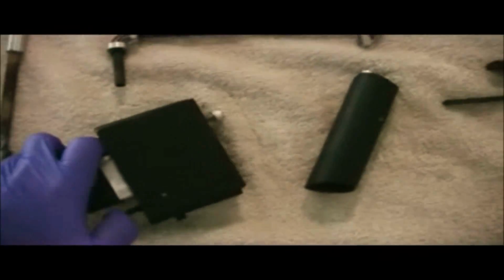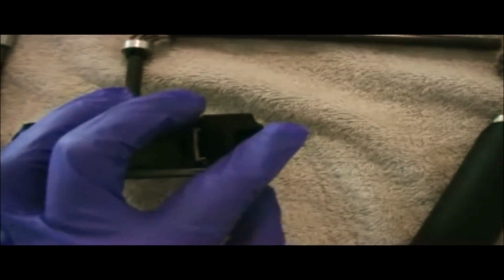This is the magazine holder. It is just meant to lock the magazine in place. Let's see, it doesn't move out. It is made out of four pieces of C-channel. See, 1, 2, 3, and 4, and I have the same aluminum bar on here. I put two of them, and a little piece of the same aluminum bar right here and here and here and here, just to make it so that the magazine would fit pretty snugly inside. The magazine release mechanism is just a toggle bolt.